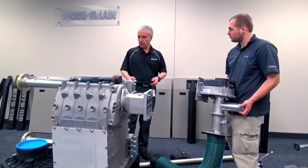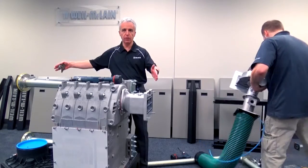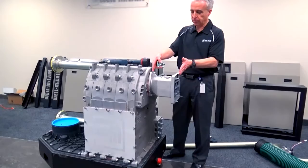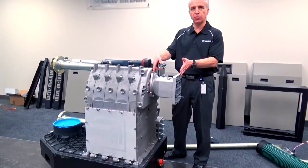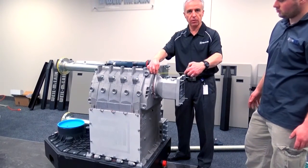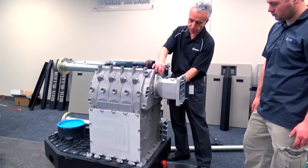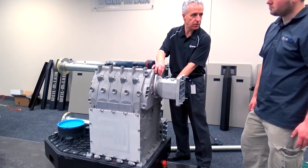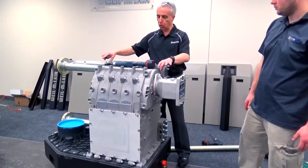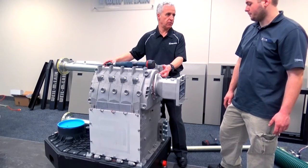And this is pretty much the end of the disassembly process. As you can see, the unit is now very short compared to what it used to be. There's one element remaining, which is the mixing tube. And this is only 9 inches long. For you to remove it, if you needed, you would remove the 3 bolts, and those nuts are 18mm nuts. And this comes off, and then you need to hold the burner, and you probably would need to think about replacing the gasket, if anything.